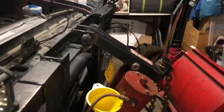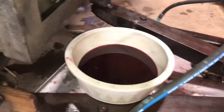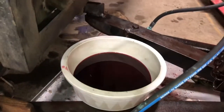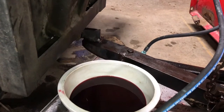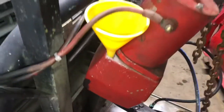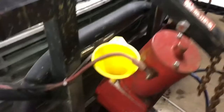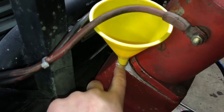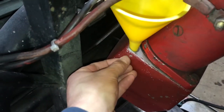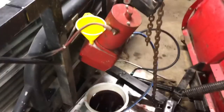Back out the next day — I looked up the exact procedure. What I'm doing is draining the fluid. There's a drain plug — just an Allen head — and I let it drip for a while. The fluid didn't look that bad, but I'm putting some fresh ATF in. This thing might take a specific fluid type; I think ATF is fine but I'm not certain. You need the lift cylinder all the way down, then fill to the bottom of the threads — not overflowing, just that amount. Then we'll double-check it.